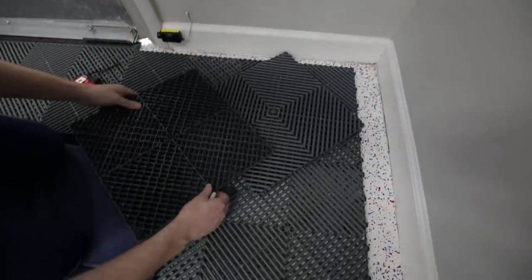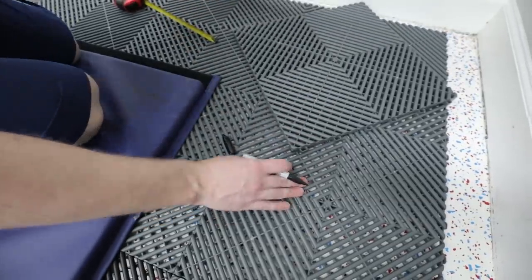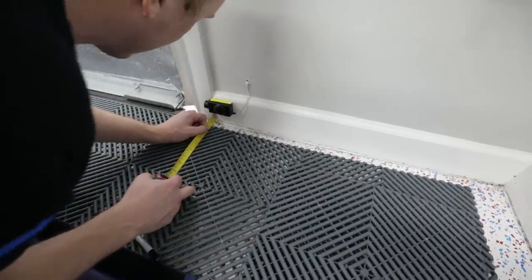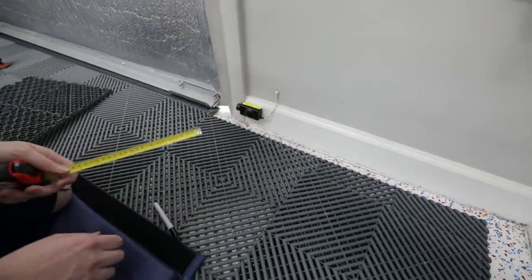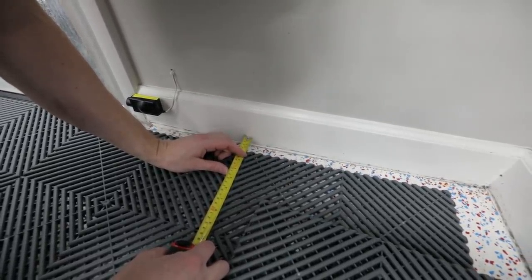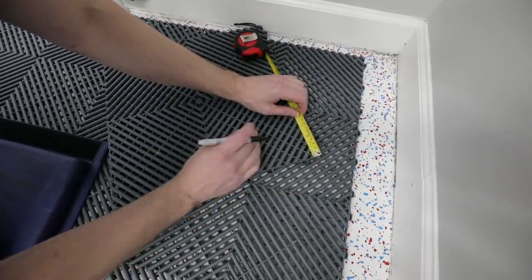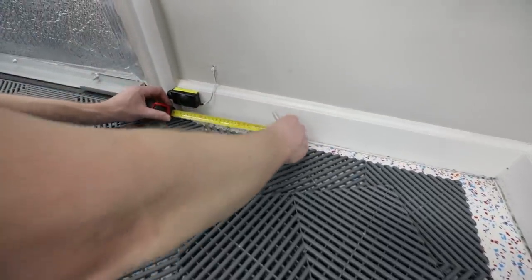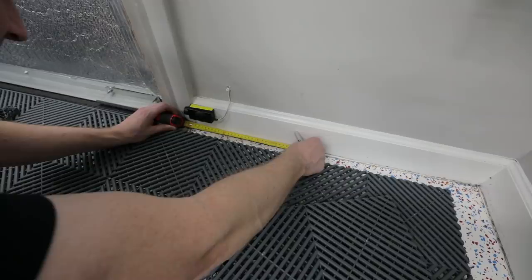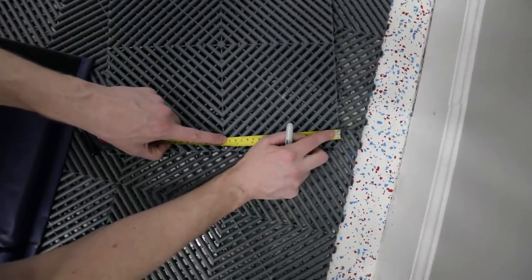One of the problems I have is that this wall is surely not straight, so I know I need to cut that straight. Taking this dimension here — from here to the end of the tile — it's one and an eighth. I'm going to start on the edge here. So I'm at one and three sixteenths roughly. Then this flat spot here — we'll just use the metric side — it's at 29 centimeters. So I'm going to come all the way out to there; that's our length.